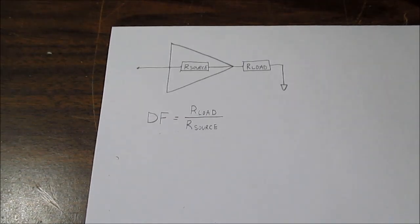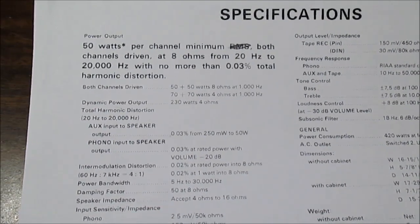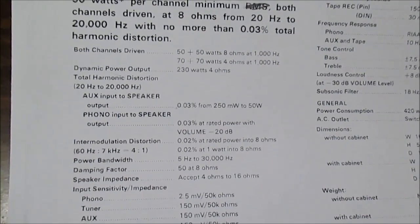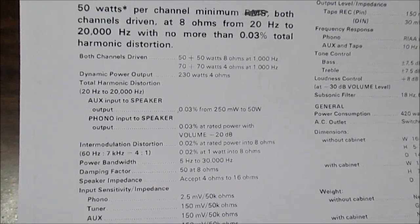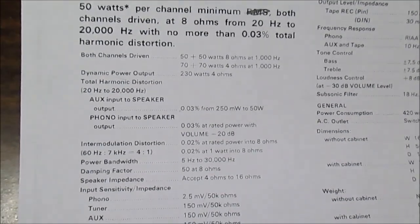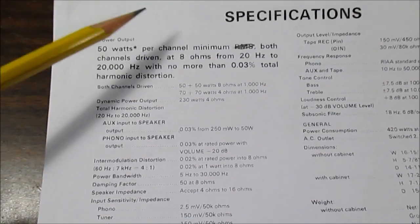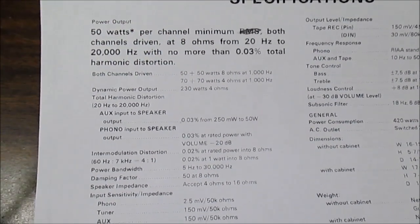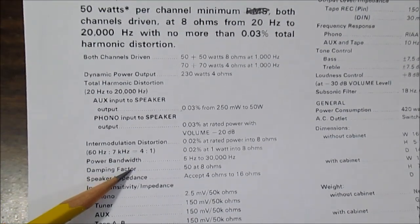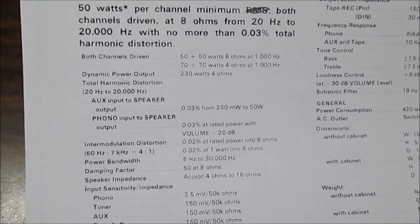You'll see the damping factor figure on the specifications of audio receivers and power amplifiers. You don't see it very often. I haven't seen any on these little boards and kits that I review on my channel, but here's an example of a Kenwood receiver. You can see down here they're giving the damping factor of 50 at 8 ohms.